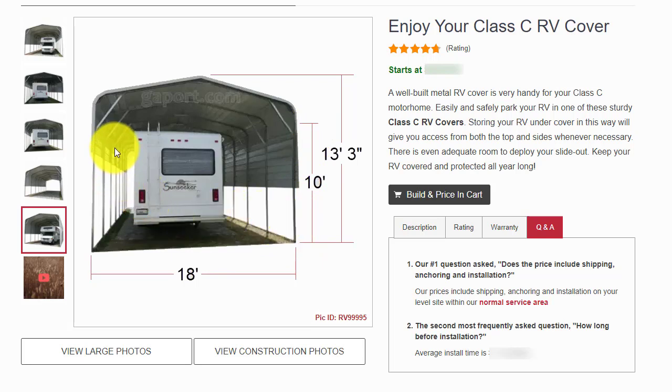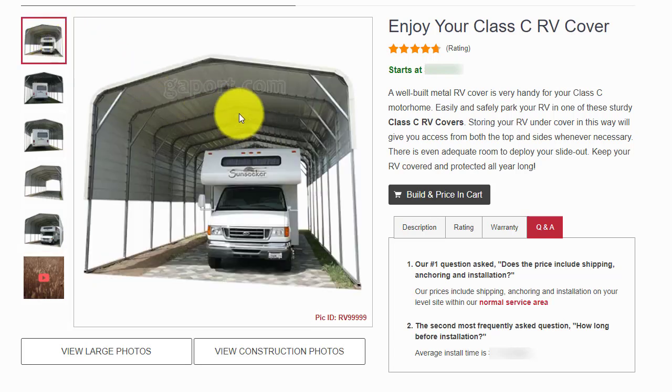Now let's look at the features. Notice the left side of this carport has one panel down — it's 3 feet. Notice the right side has two panels, so it's 6 feet down with extra coverage, leaving 4 feet open at the bottom. This is adjustable; you could put more or less if you'd like. Notice that our unit has braces at every leg and center peak braces per the engineer specifications, shown here as well.